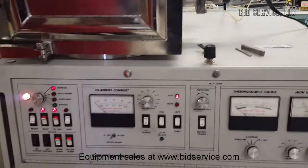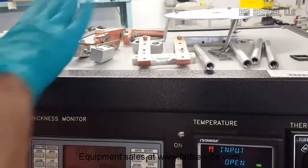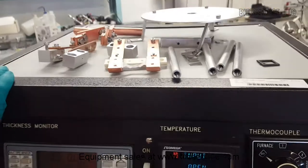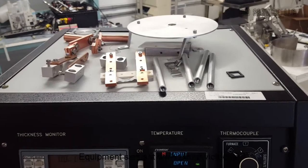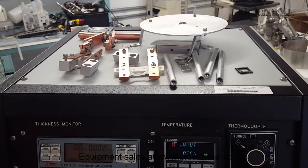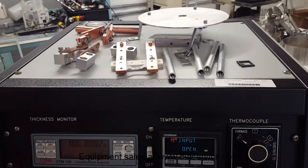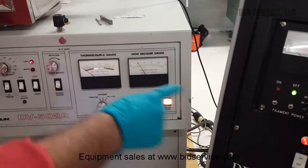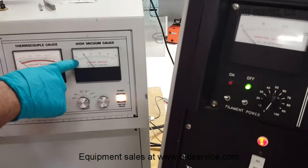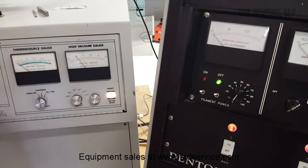It is always safe to remove all the thermal evaporator electrodes and connectors, and shield everything out of the chamber whenever the e-beam gun is in use. Because there are high voltages, there could be arcing or short circuit possibilities with all these conductive parts inside the chamber. As the e-beam is turned on and the filament current is cranked up, there is a possibility that the high vacuum gauge will start to read lower vacuum levels, which is normal.